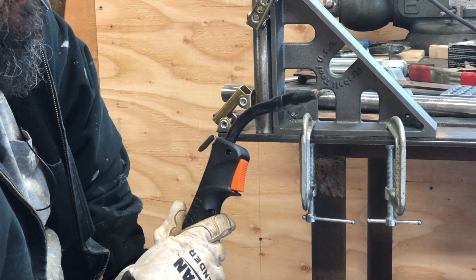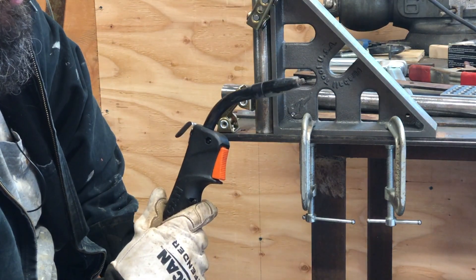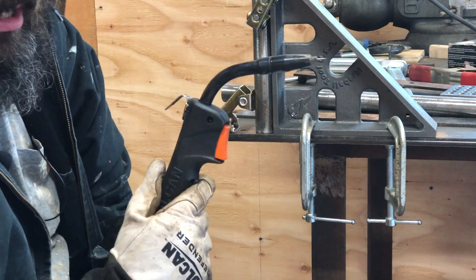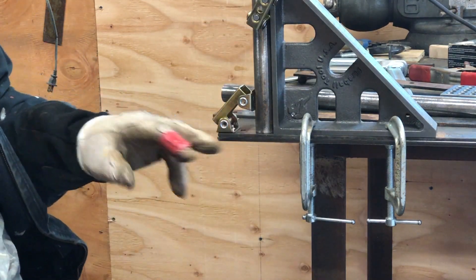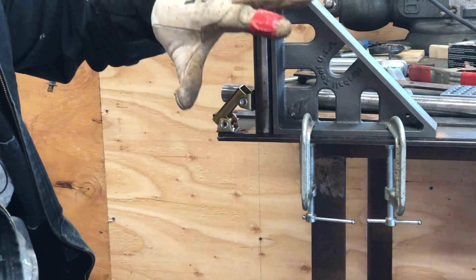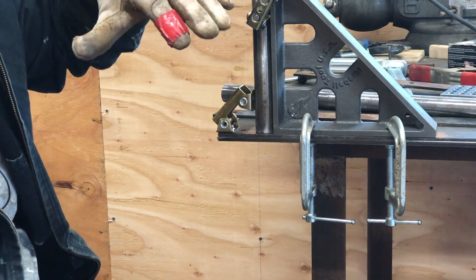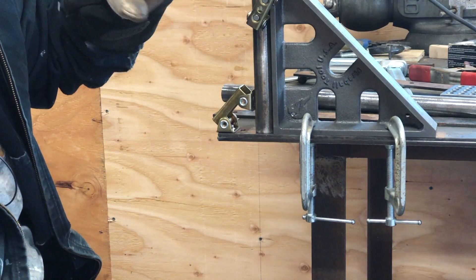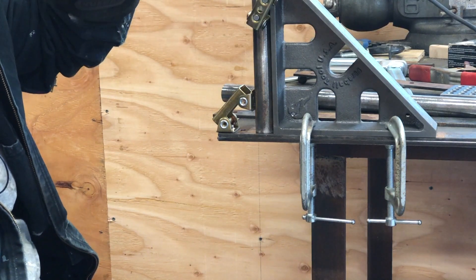So join me in making this little lumber rack I'm gonna hang on the wall - here we go. I'm running flux core point oh three five. Just in case you guys didn't know, I'm a novice welder, a beginner welder. I'm gonna tack it in a couple spots, move my clamp down to get the other bar on, then once I have both bars tacked into place I will come back and weld the circumference.